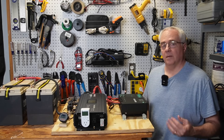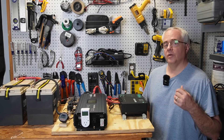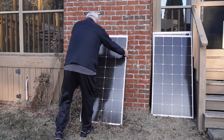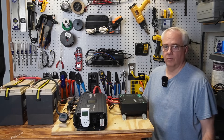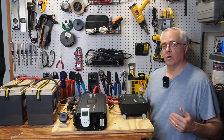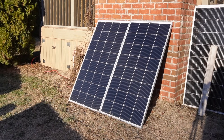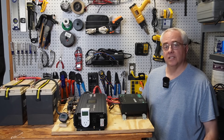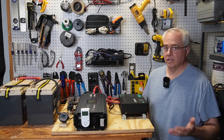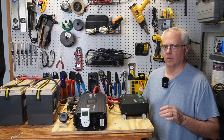The first thing this experiment taught us is that powering something like a freezer or refrigerator with only solar power takes more solar panels and battery capacity than most people realize. When you increase the battery capacity, you need to also increase your solar panel capacity because you have to be able to charge the extra battery back to full. A single 100 amp hour 12 volt battery and 200 watts of solar panels could help you get through power outages, but you definitely could not rely on that long-term. The single 200 watt panel was just not enough to get the battery back to 100% within a single day. Adding a second 200 watt panel — for 400 watts total — allowed the solar to charge that single battery back to full in a day. Since the battery was able to last from the end of the sunny day to the next morning, this setup could power the freezer indefinitely given enough sun each day. So 400 watts of solar and a single 100 amp hour 12 volt battery would be the absolute minimum.